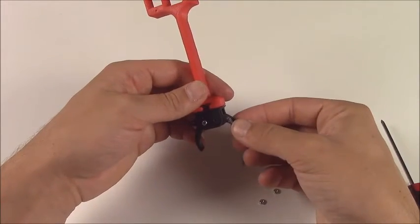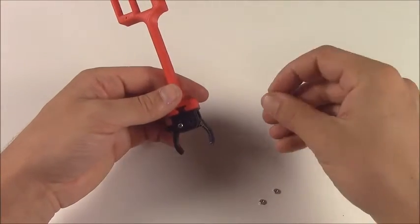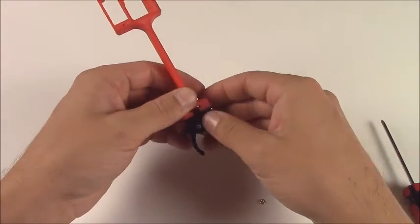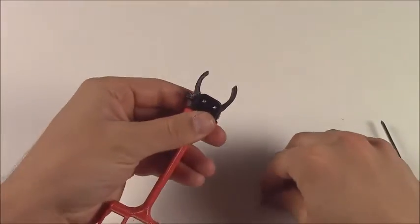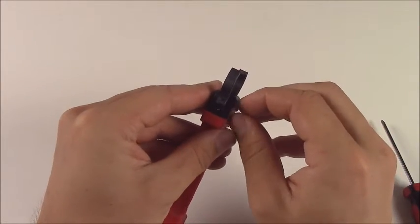When you put in the second pincher, make sure that it is a mirror image of the first one. That way you know your gripper will work evenly. If it's not, then one finger will be all the way across and the other one still has a way to go. You want them to pinch in the direct center, so make sure that they are symmetrical.